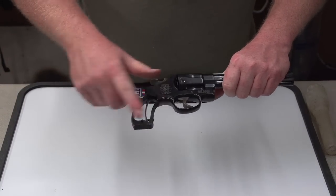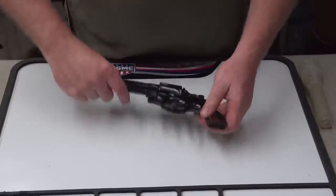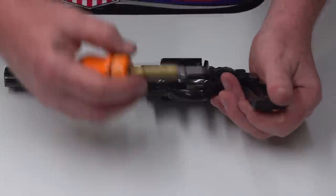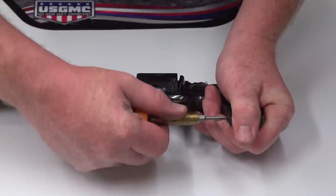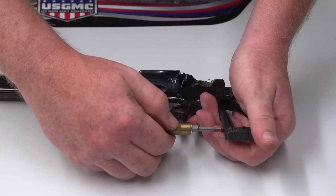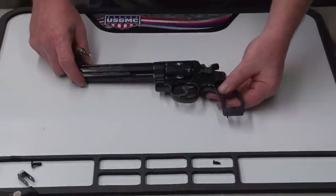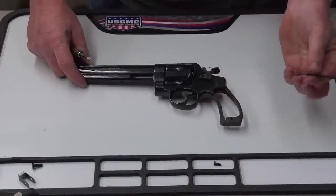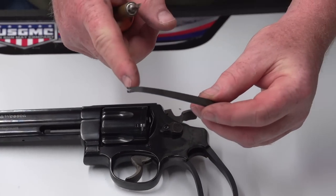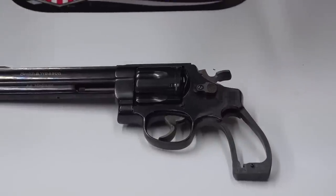As you can see, this particular model has a rounded frame like most of the newer guns do. Next thing we're going to do is release the tension on the mainspring with the strain screw. The mainspring can then be taken out — it's a flat style spring. You'll find this design to be the most common, with the two finger hooks. When you get inside the gun, you'll be able to see what style of stirrup it has on the hammer.